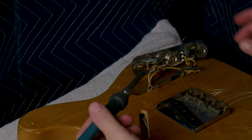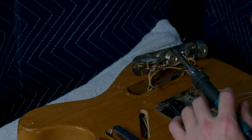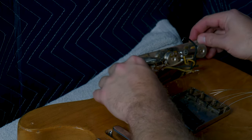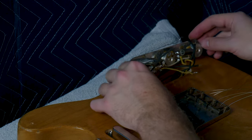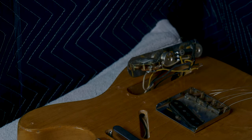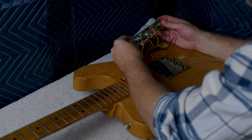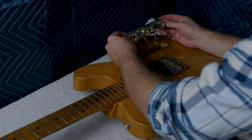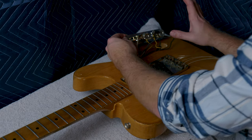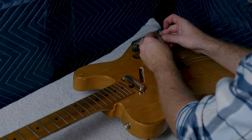These were just contact soldered in before, so I just stuck that hot lead, as you'd want it to be, through the peg on that switch. I'm not interested in making this less reliable, so we're gonna do it the right way rather than just a little contact. I think frankly it's a little bit lucky that that stayed in before. I like to overstress the joints because if I can't break them with stressing them, then I know they're gonna hold up in the guitar, because they don't move in theory once they're in, but you know you have to bend them into place. So I just like to make sure they are nice and attached. Also probably looks crazier than what I'm actually doing.